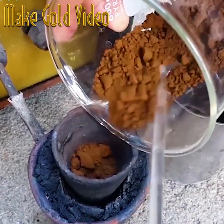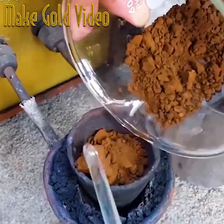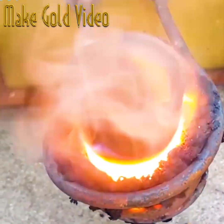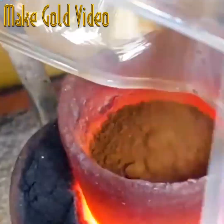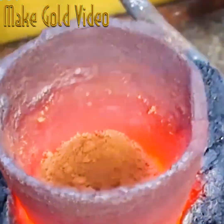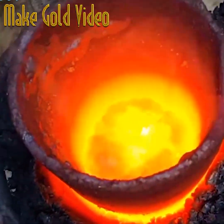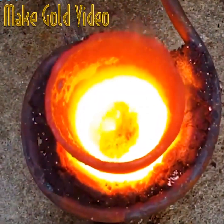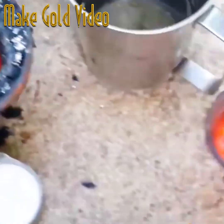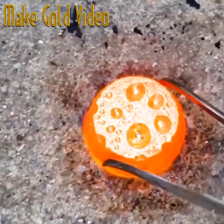While that looks a little brown, what it actually is is fairly pure gold. Now it needs to be heated up — in this case using an induction heater and a graphite crucible. Just look at that glowing! The rest is added a little at a time, and then in the end a little borax is added to help further purify it and help it bond.